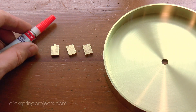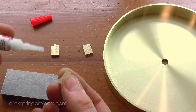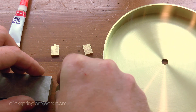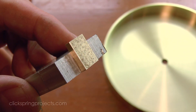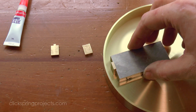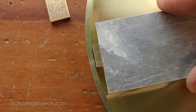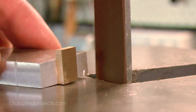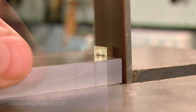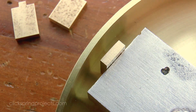The plate supports will eventually be soft soldered to the inside perimeter of the bowl, and so require a very light camber to match that surface. But they're awkward little parts to hold for shaping, and are much easier to work with if given a more convenient handle. The amount of metal to be removed is quite small, requiring the barest touch to the belt sander. But even that small amount of material removal is enough to significantly improve the fit with the inside perimeter of the bowl.